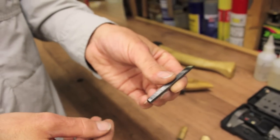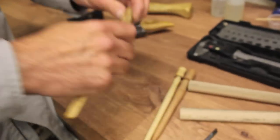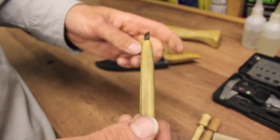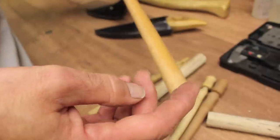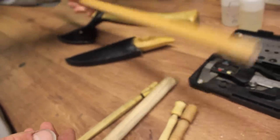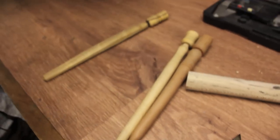This is made from silver steel, a fairly readily available knife steel. You can also make similar blades from high speed steel - the same steel used for drills - and you can buy it pre-hardened. So you don't necessarily need a forge; all you have to do is grind the bevel on and stick it in your handle. The material we're going to start with for the handle is some dowel I've turned from London plane wood with a little bit of spalting.